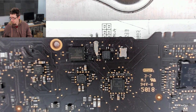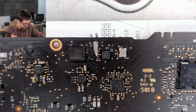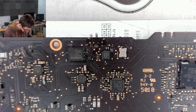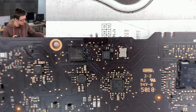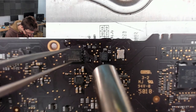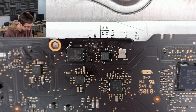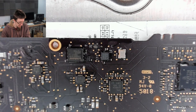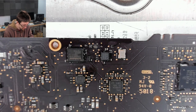Add some flux and come in with the hot air — 450 degrees, about 50% airflow. I'm just going to warm the area up. Move that hair out of the way because that's going to smell. I'm going to get my super-duper tweezers out for this one because it's really small. That's the resistor off. Now I'll come in with the soldering iron and some fresh solder — that should reflow and clear up this area.